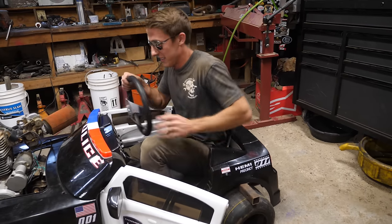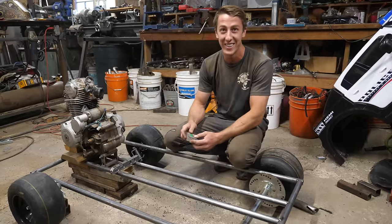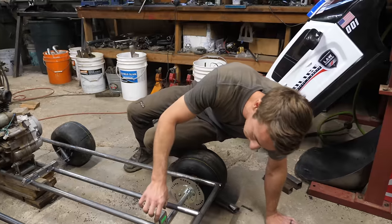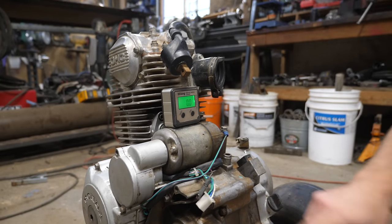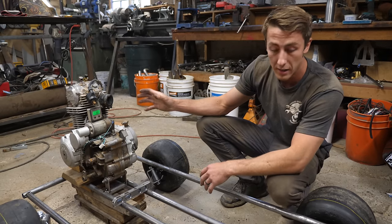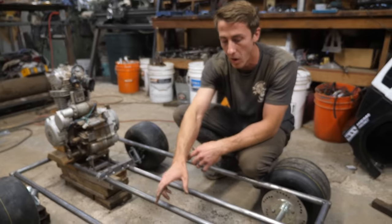The door is still open so that's cool. We talked about working from a square frame and how helpful that is. The next thing is level — if you have a level shop, a good old-fashioned level is going to work. We don't have that luxury here at Grind Hard, so we use one of these digital levels, pretty cheap on Amazon. I'm going to start it back here on the axle, zero that out, and then just work off level using that as a baseline. I put it up here on the engine on a somewhat level part and it's actually pretty accurate. Me and Ed twisted this when I did these tacks on this engine mount, and we'll do the same on the front mounts. If your engine's off then the chain alignment's going to be off too, so keeping it level will make that chain last longer and everything go together smooth.